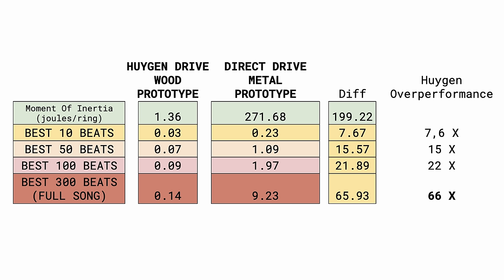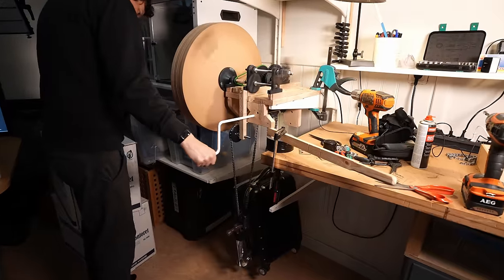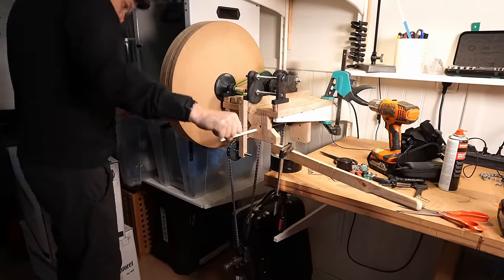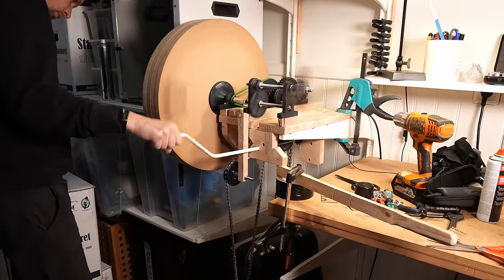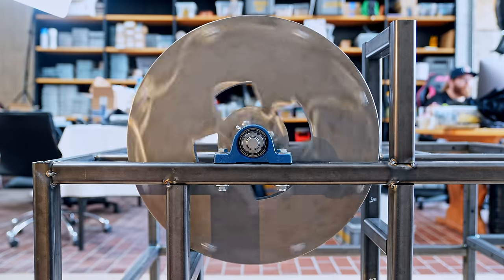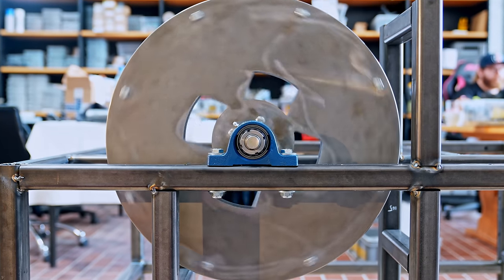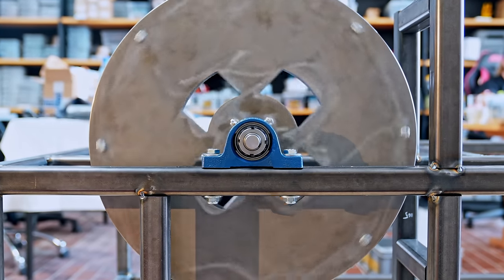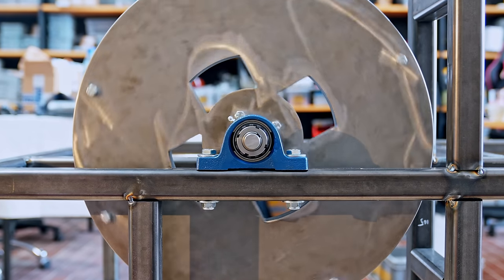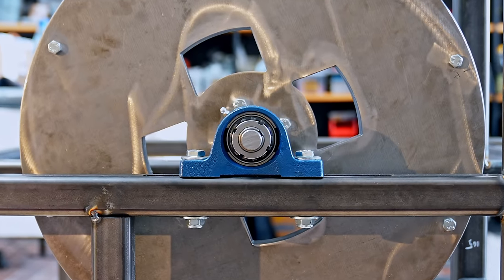It is still 66 times tighter compared to the prototype I built in Germany, but it also means I haven't managed to solve the tempo drift issue. One interesting aspect is that some of the acceleration of the tempo over time was affected by the grease in the 10 bearings loosening up. Just like the air governor adds friction to the system, the bearings also add friction, affecting the balanced tempo. So when the friction from the bearings reduces, the BPM speed goes up. The flywheel in Germany was 200 times stronger than the flywheel I'm using here, and on the real machine a huge, super strong flywheel will make everything better. A stronger flywheel will care less about the difference in friction from the bearings.